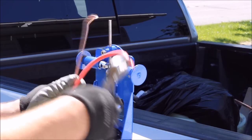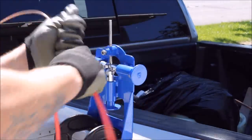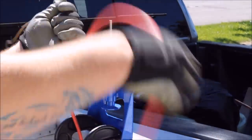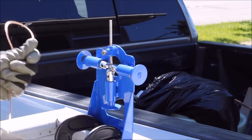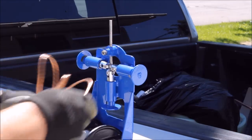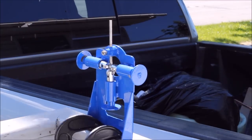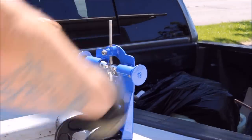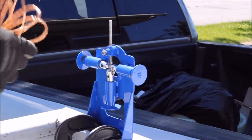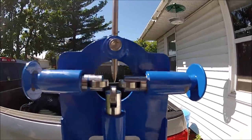It's actually really good that I made this video as late as I did, because it is the end of the season — snow's on the ground — and I have put over 800 pounds of bright number one through this wire stripper. The gross weight was close to 1,300 pounds of insulated wire. I haven't changed a blade on it, I haven't sharpened the blade on it, and it's really not in need of a sharpening anytime soon. The cost is the main factor though — this wire stripper basically cost me 20 pounds of copper.